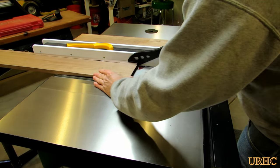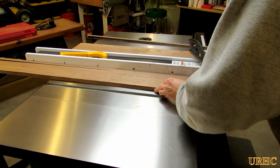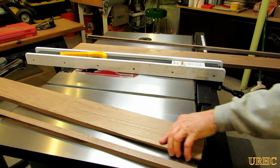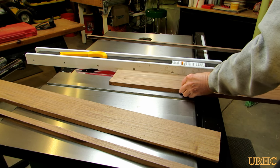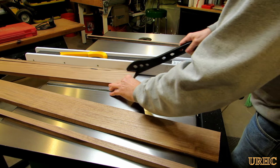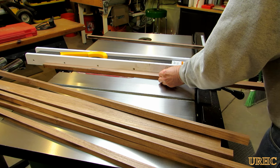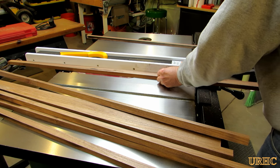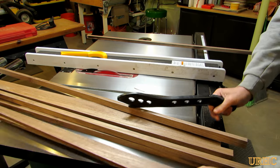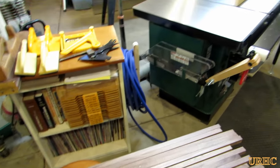It's basically a little narrow frame with a rabbet on it, and this outer frame is made with a little bit of clearance to go around the needlepoint so there's room for the corners to fold in. I'm kind of hoping friction will hold it in place when I'm done. Here it is just cutting all the strips to the proper width — cuts like this I don't really like doing because you can't use the guard on the table saw; there's really not enough clearance. So you have to be really careful. There they are, all the strips ripped to width.